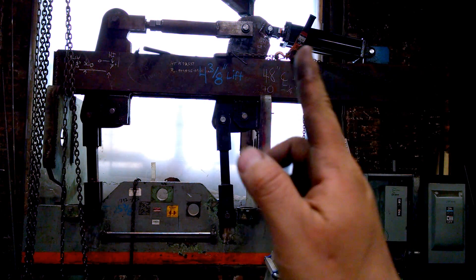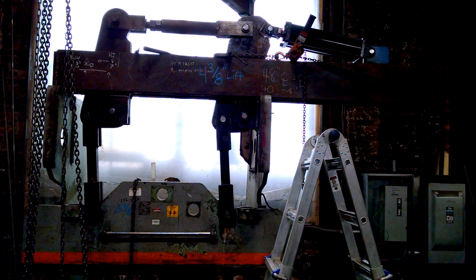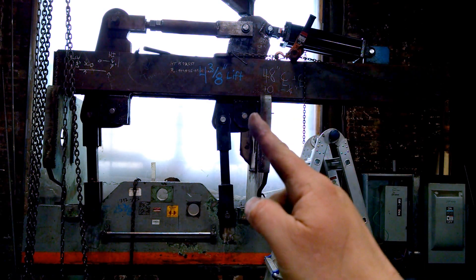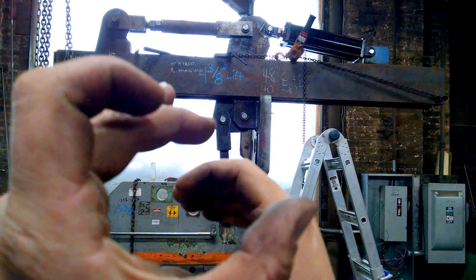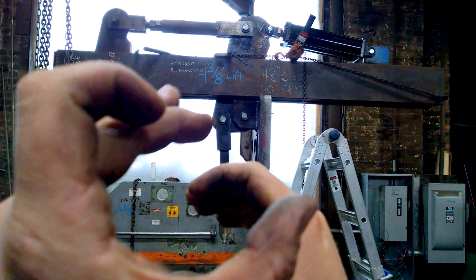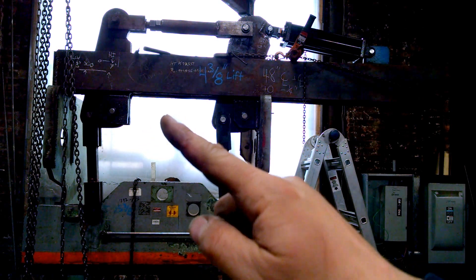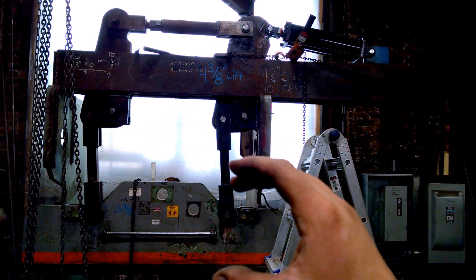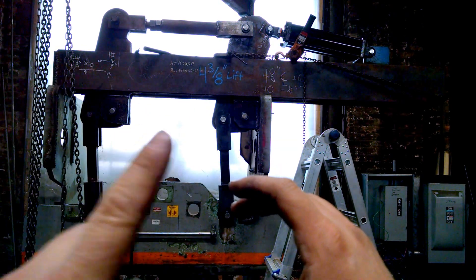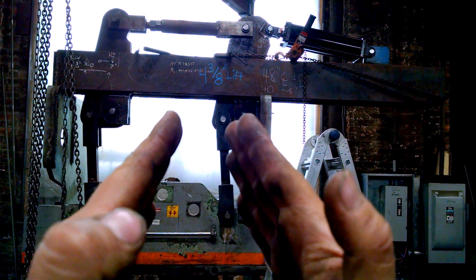So last time, in my first video, I was just kind of showing you guys the mechanics of it, how everything was going to work. But I found there was a problem — my actual guides were not in alignment on my cam. The holes were literally off like an eighth of an inch, which royally screwed up the alignment. So I scrapped those, cut new tabs, welded those all in. When I welded them in, I threw my pin through with my bushing, tacked it up, and went really slow just to make sure things didn't pull out of alignment.